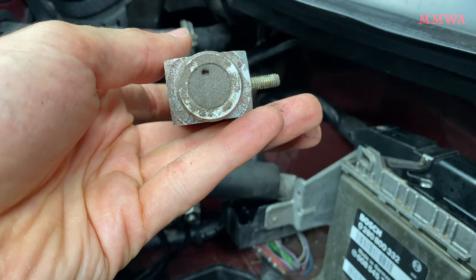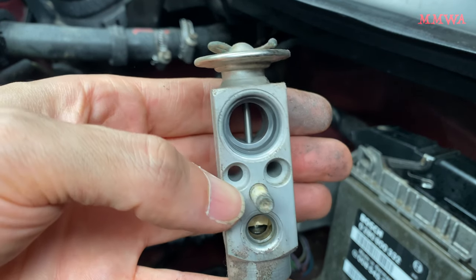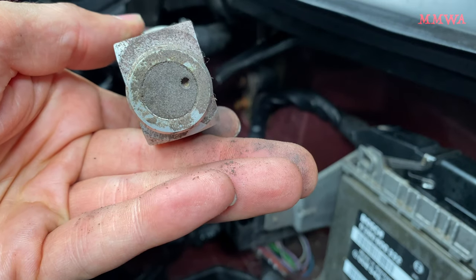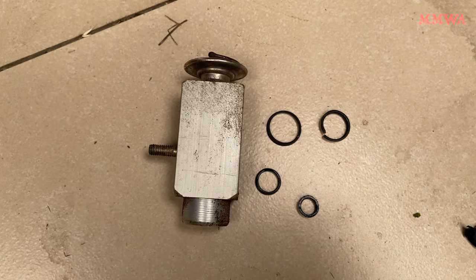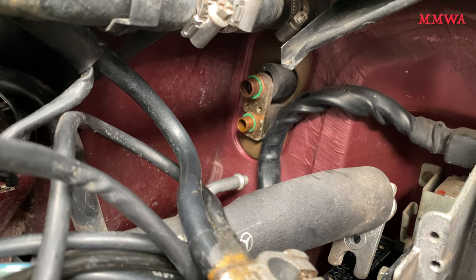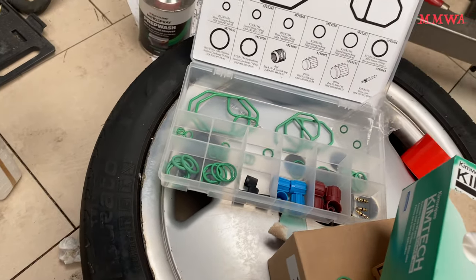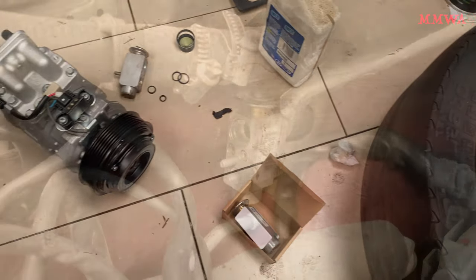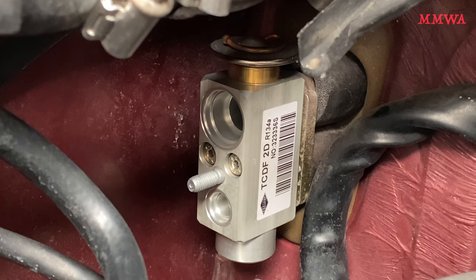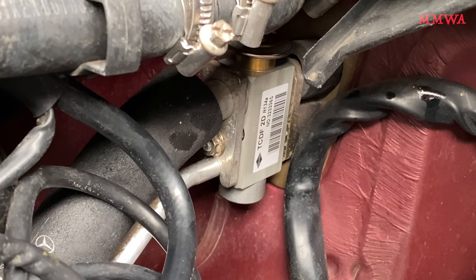I think this is original — I don't see any markings on it, but the kind of price tag sticker it has up the top reminds me of what MB ones look like. Of course surgical cleanliness is required; everything was cleaned before the new O-rings were installed, and I do lubricate them with compressor oil as well. The new TX valve is now installed with its new O-rings, and the hard lines are installed on the other side with new O-rings as well.